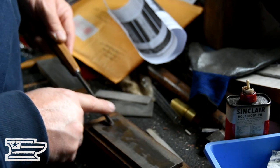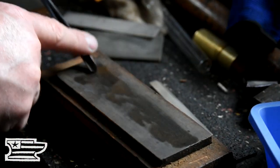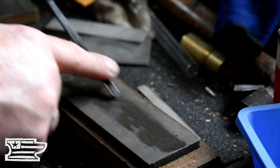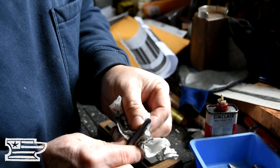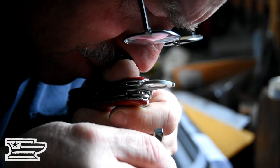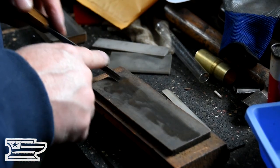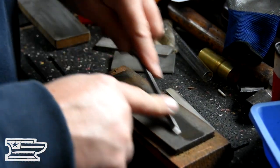Now I've shortened my rotation — how many degrees I'm rotating the tool, because my point is mostly right out in the center. I'm just wanting to work on that where most of the material is. I don't want to cut the sides back while I'm chasing the point. How many strokes are you doing before you check it? On that fine stone, maybe eight to twelve. We're basically to an edge now — put this side down a little further, knock any inside burrs out and see where we are. I might go put it on the strop and see if it will come to an edge.